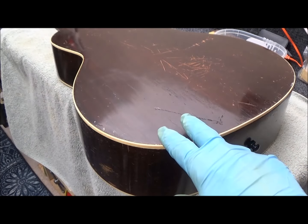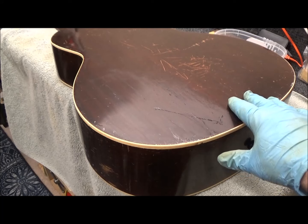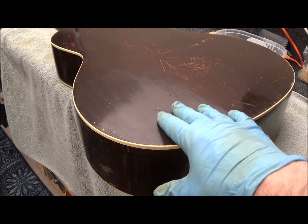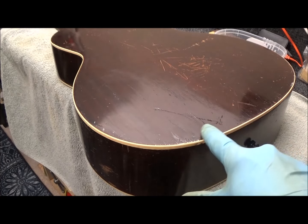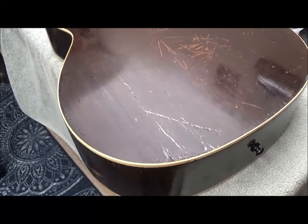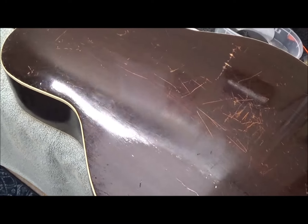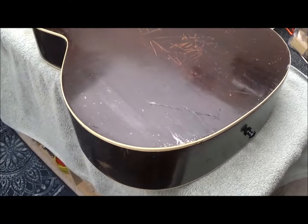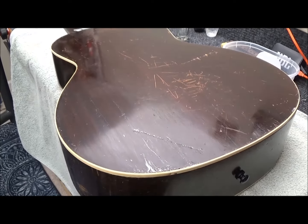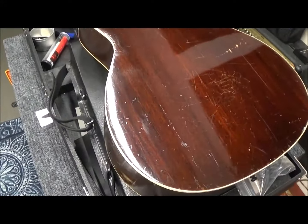Here's a look after drop filling, and then a week later I wet sanded it. I did not use water because of the old checking cracks — I wet sanded with mineral spirits to keep water from getting under the lacquer and causing blushing. I went through 800 grit, 1000, 1200, and then took it to the buffer. The sanded area is really flat. Let's give her a buff. Just got done polishing up that back — I hope I didn't make it too shiny. It's all dented up over there; maybe I should scratch it up now.